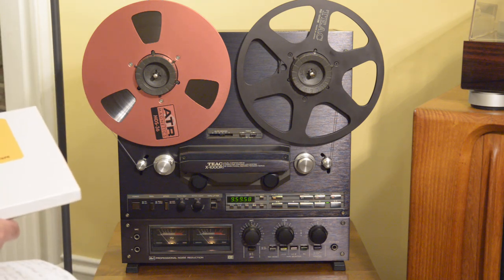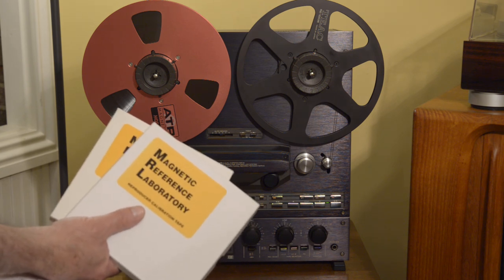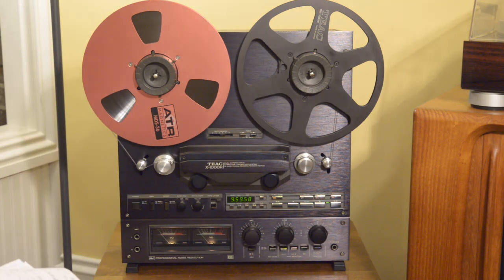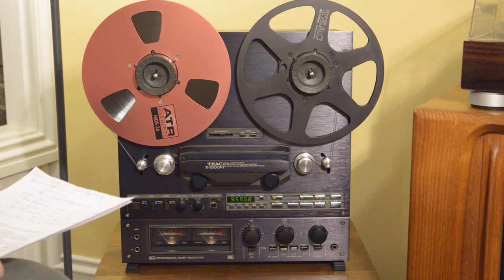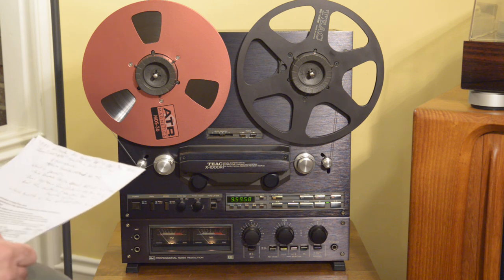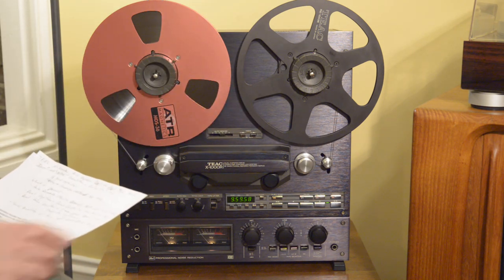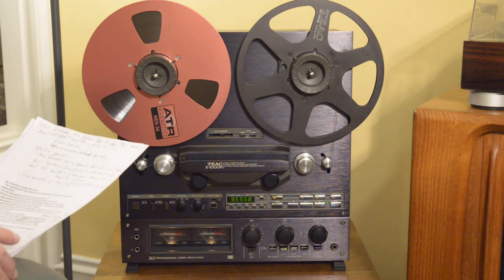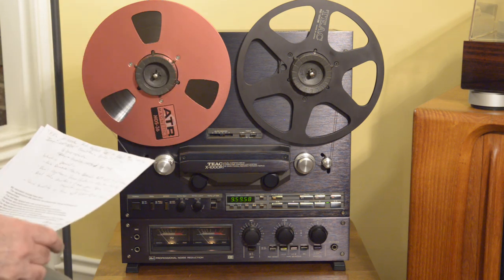From the standpoint of frequency and wow-and-flutter, you do need a couple of MRL tapes. One is for your speed and your wow and flutter; the other is for your frequency response as well as your azimuth — which is the alignment of the tape heads. These are all essential. Other than that, it's just normal stuff like an oscilloscope and a frequency generator. At the end of the mechanical restoration and mechanical alignment — which includes tape path, tape tensions, and so forth — this one came out to 0.032% wow and flutter forward, 0.038% reverse, well within spec of 0.05%.